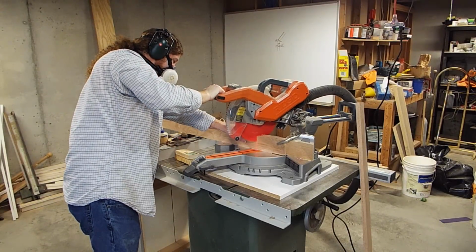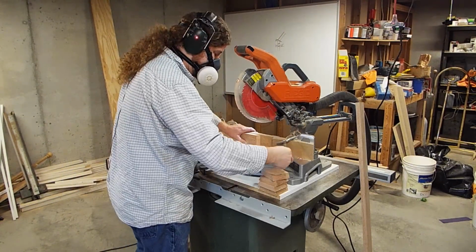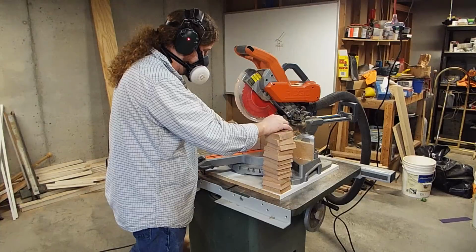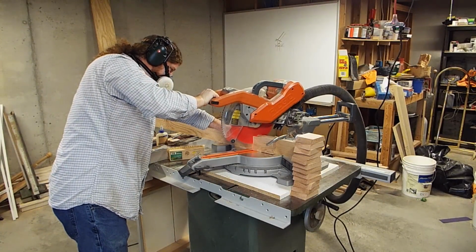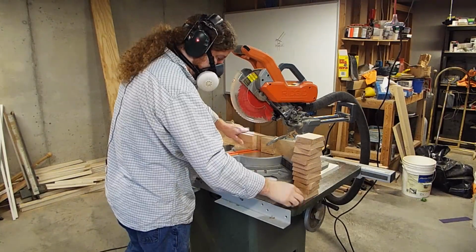Miter saw montage! The angle of the saw is set at 22.5 degrees. Each cut is done with stop blocks for reproducibility. Most of the rack is made of exactly the same parts: trapezoid pieces which will get the bottle holes, parallelogram pieces to offset the bottle holders, and 2 small trapezoids at the top and the bottom.